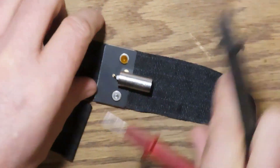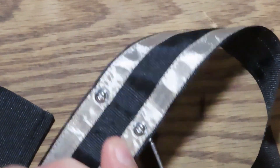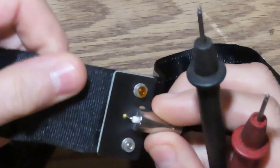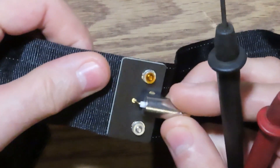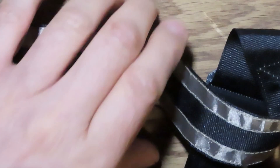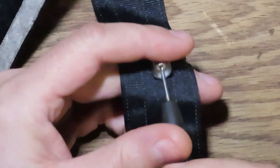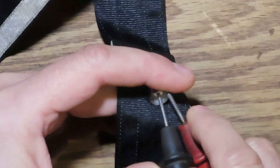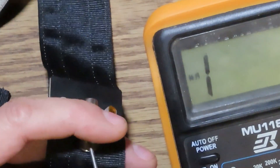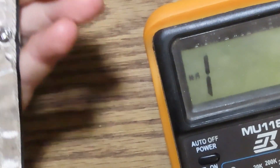Now this is his connector here. He's got two hex-head bolts going through — that's how he's making his connection to the PC board. It is glued to give it physical strength, so it's not just relying on those bolts, because that would tear the fabric over time. This should go from the center of the conductor to the shell — no trickery going on here. It should show zero ohms, a DC short. Yep, exactly. Real simple construction.